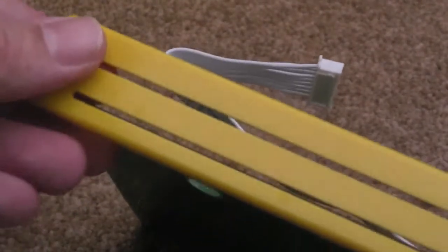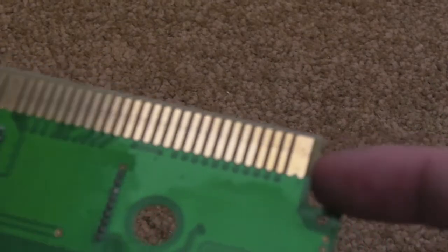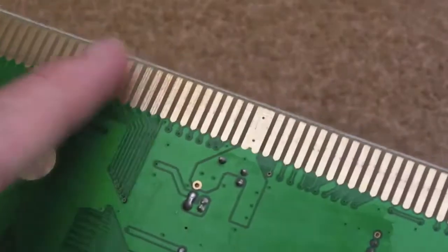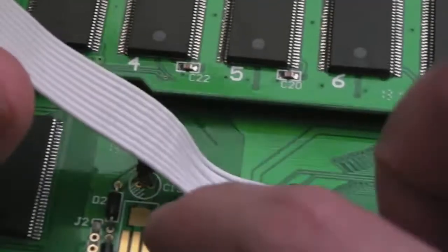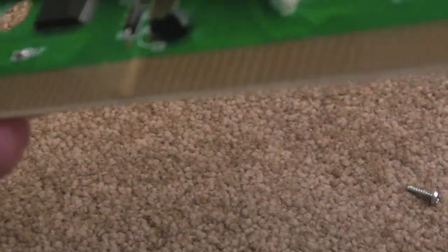So what I'm going to do now is prise this off — there we go — slide off a little bit. And I'll just file the edges of these down with some needle files. If you look at it like that, you can see where the copper ends. You've got quite a large piece of exposed plastic or PVC on both sides, and I'm just going to file that down by about half a millimetre on each side and then try it in the system. The edge there is looking a bit dirty as well — there's a weird angled scratch across it — so I'm going to clean up the edge connectors while I'm here. I might even swap out these diodes for a 3.3 volt voltage regulator, but I might do that another day. The cart is working, so I'll just deal with cleaning up the edge and filing these edges down.